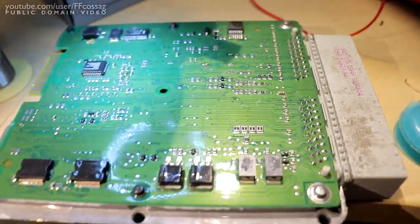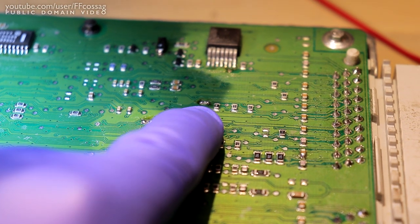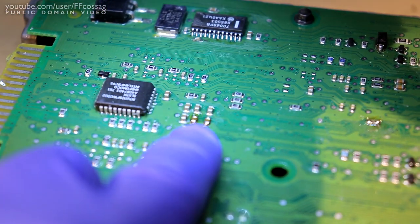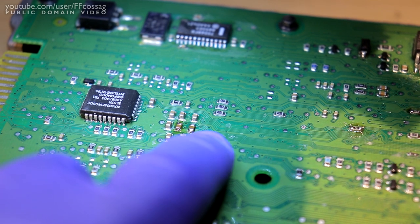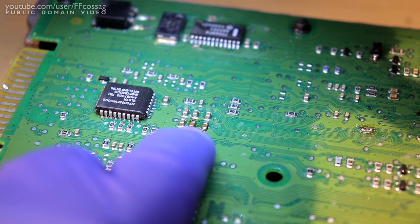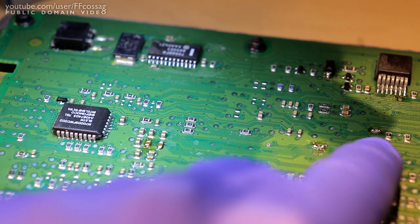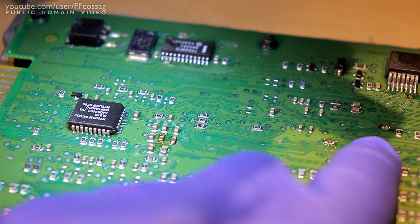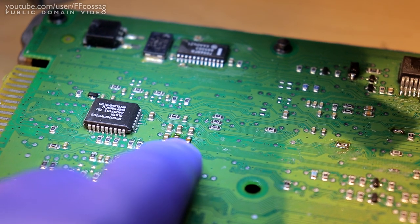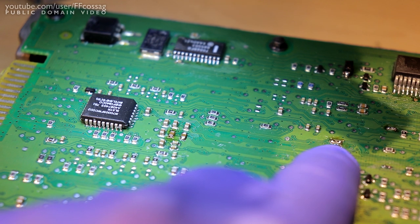It comes down to a few components on this side of the board — namely these two resistors. I think that one is for the intake air temperature and that one is for the coolant temperature. As well as the decoupling capacitors over here: the right one is for the intake air temperature and the left one is for the coolant temperature. I first had an issue where the intake air temperature sensor had a shorted cap and a bad resistor. I replaced those, and then the resistor and capacitor for the coolant temperature failed right after — the capacitor went short circuit at about 450 ohms.